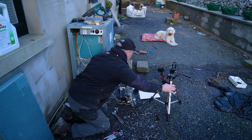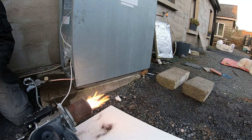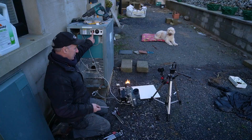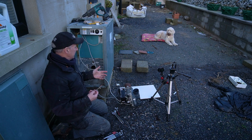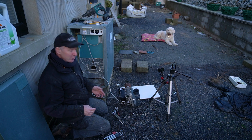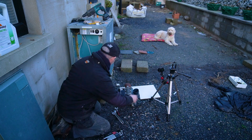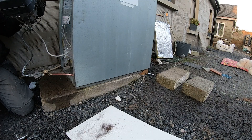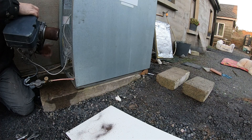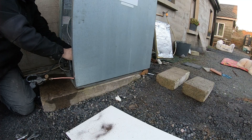Just move that so you can see the flame. Now that's it — I have it working for tonight. This is just to get them going. The nozzle needs to be changed and I need to set the pressures and so on. Now I'm just literally going to put this back in the boiler, hit the button and go. There's not a lot to putting this back in — it's on a flexible line, it's got a power cable going with it. Just move the wires out of the way.